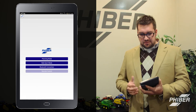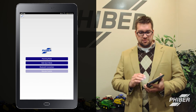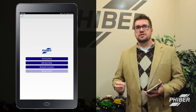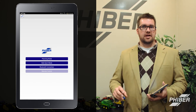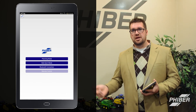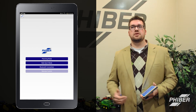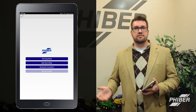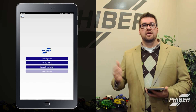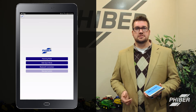Very simple — a couple of different options there. The last mode you can go into is a remote control mode. With this remote control mode, you can manually power any function on the accumulator, whether it be the flat accumulator or the stacking. So for maintenance or service — eject the last bale out of your chamber, open the tailgate to let it roll out on the stacking accumulator, or push it off with the flat — you can manually power any cylinder or function on the accumulator in those situations.